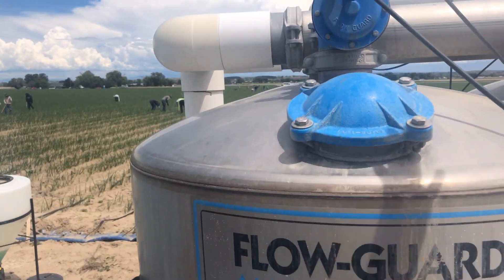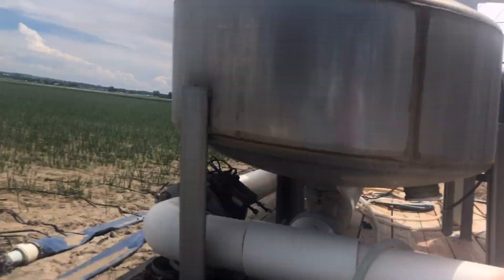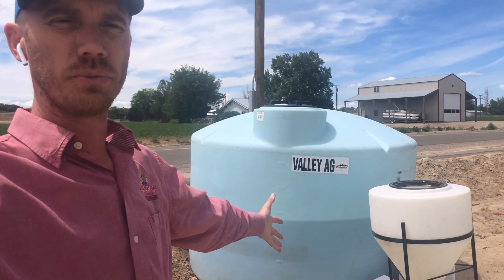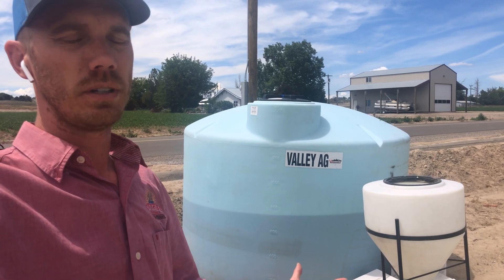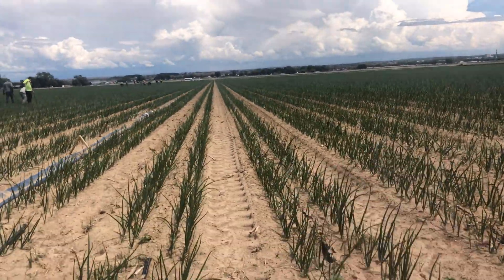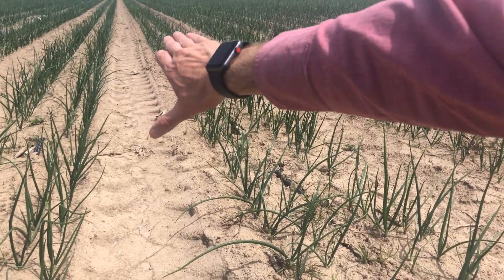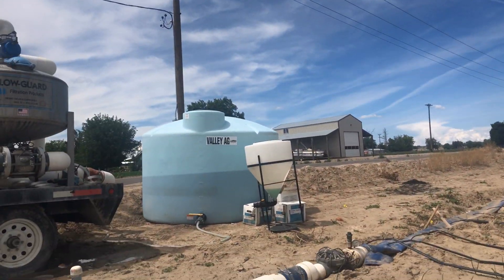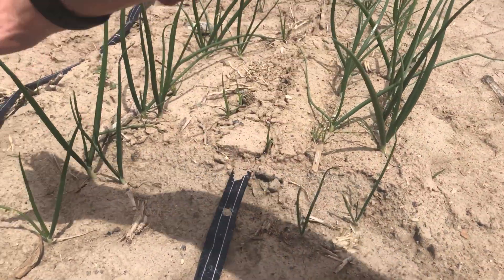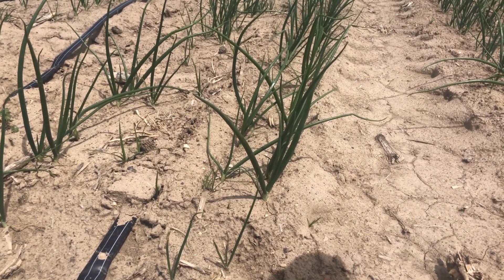The water will come in, feed in, pressurize into this manifold, come down and through the sand media filtration, and then come out the bottom. That tank behind me is going to be utilized for adding fertilizer to the field. In the past we would have had to drive a big spreader wagon through the field to apply any fertilizer, and we'd be casting the fertilizer media all over — putting fertilizer in the middle of the row where we don't need it. By using that tank and running it through the system, pressurizing and coming into these drip lines, we're only going to put the fertilizer right where the plant can get to it, so we don't waste so much.